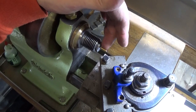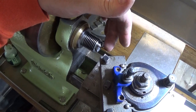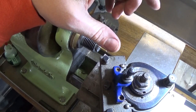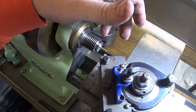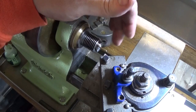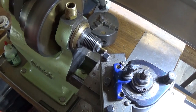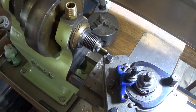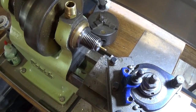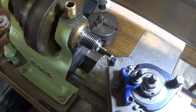I found an eighth inch collar and we've chucked up a piece of brass rod - we're just going to turn the end of it down. The hole that we reamed was three millimeters whereas this shaft is one eighth inch, it's 0.2 millimeter over. It needs to be the right size on the piece that sticks out, because otherwise your timing is going to be out a fraction - one or two degrees anyway. So let's put a step on this that's going to press into that crank, cut it off and press it in. I think that's going to go in there nice. Little bit of a taper on one end, nice fine fit. I'll cut it off with a hacksaw, push it in and assemble it all ready to machine again.